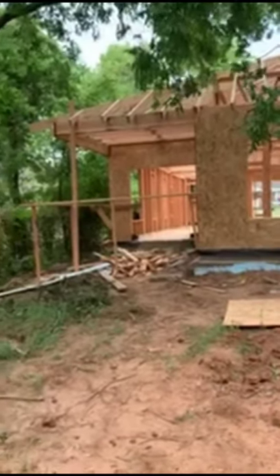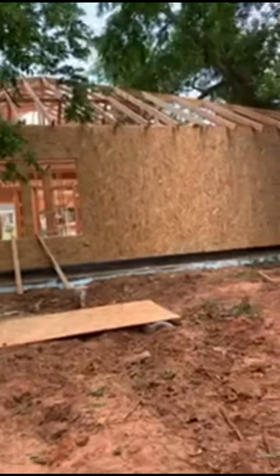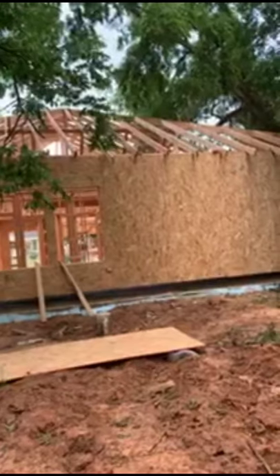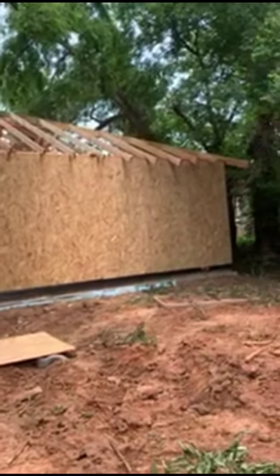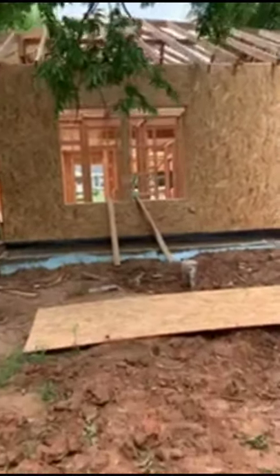Here's the back of the house — that's the patio there. We got a little bit of cleanup to do, but we're not quite done with the framing yet. We've got to put on the decking. We'll be putting on radiant decking so that it helps with the utility bills and makes the attic quite a bit cooler. We've got a post-tension foundation. It's insulated, and we'll get all the trees and overhang cleaned up later on, but let's go look inside.